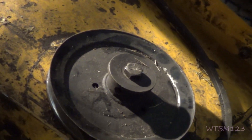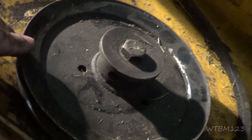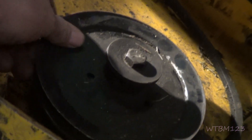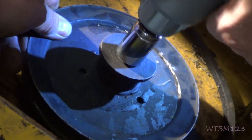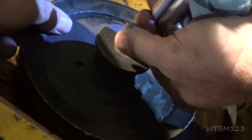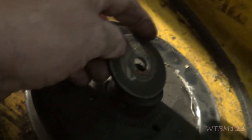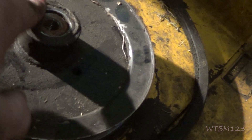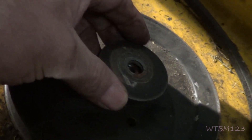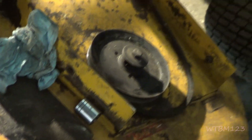That nut was 15/16 — it's a little loose on the back one. I'm not sure what this one is. That's a 19 — about like a three-quarter or something. So what we're going to do is take this bolt out and fit that washer. I can see that washer was on the wrong way. It's got to be this way so that whenever it pushes down, it'll stay tight. And we just tighten it back down. We're going to do the same to the other one.